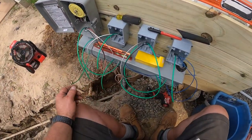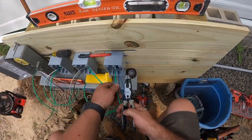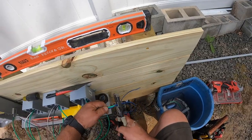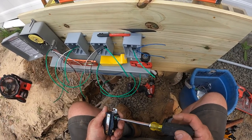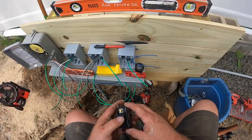Back at the trough, I've got wiring coming into the trough and into the three individual boxes. That box right there is going to be my 240 volt saltwater filtration receptacle — that's a NEMA 6-20. It's two hots and a ground, no neutral for this circuit.